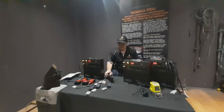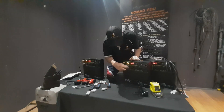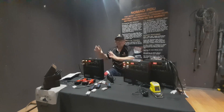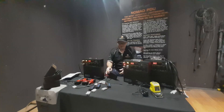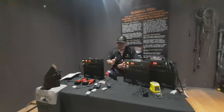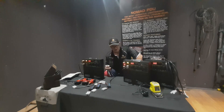When you plug it into your Nomad you plug it into the red Anderson area, which is the red circle area — this is a regulated input. That means you have to ask: is the power you're putting into the Nomad regulated or not? We do have a regulator here, but this is a charger putting out a nice solid 8 amps going into the regulated input. The charger is now showing red — it's actually charging.